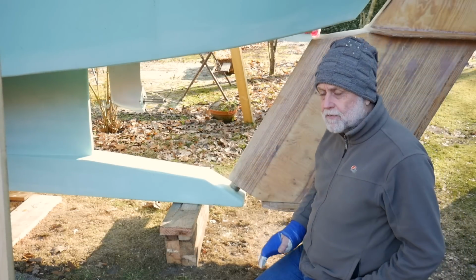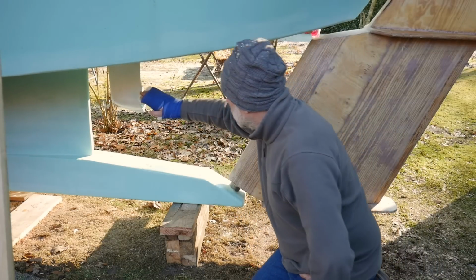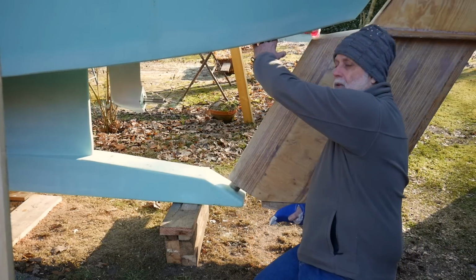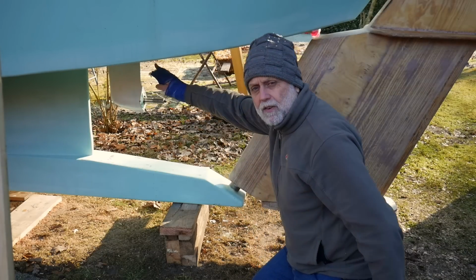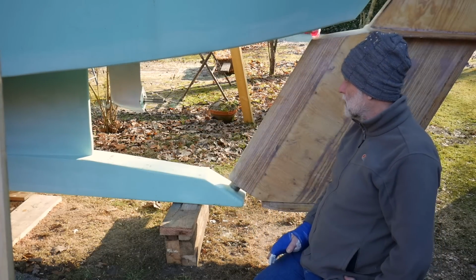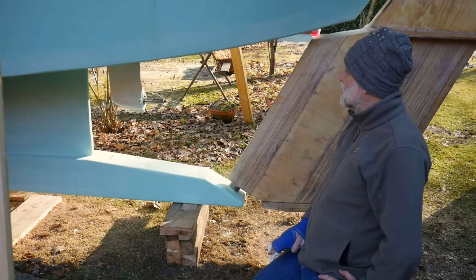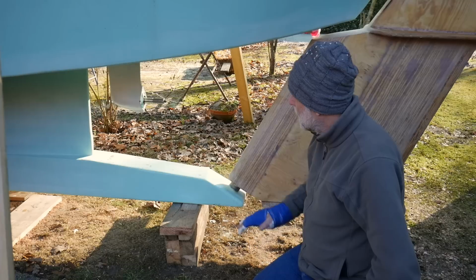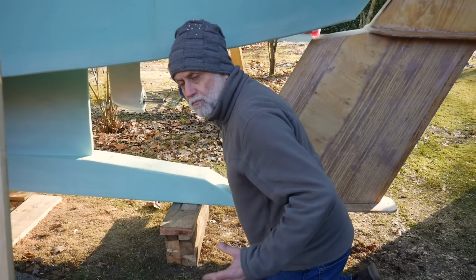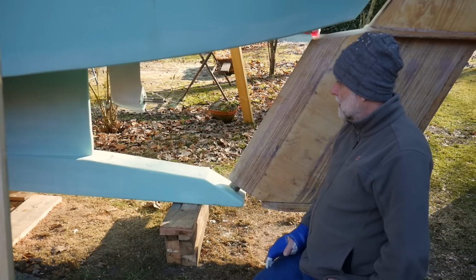So here up at the aft end, looking at the sail drive, still need some more anti-fouling on it. But once the bottom is epoxy sealed, I've got this rubber boot that goes around the sail drive that we glue on with Sikaflex, and then obviously the propeller and the anode and propeller end nut to go on there. I've got them all, it's just quick work really. I've got all of those parts just waiting to go.